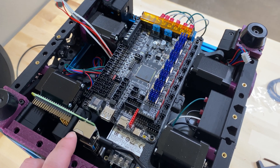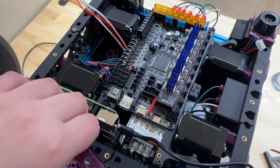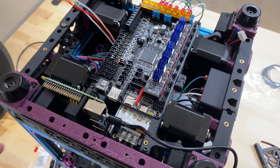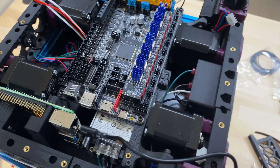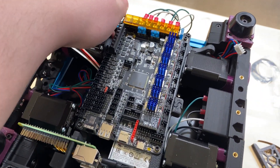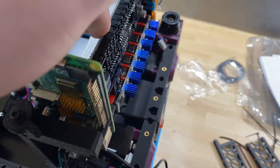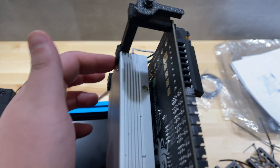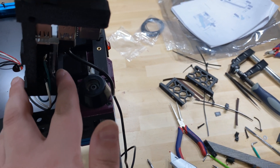Here is the new electronics mount with the Raspberry Pi in the new location. I checked and it doesn't hit the panel, which is nice. Even if the latches come loose, it'll just be the side of the PCB — no pins shorted. The setup has a hinged mechanism, though if I were designing this myself I don't think I'd go for this hinge. It's nice to be able to reach all the electronics, but the DC side is covered by the Octopus anyway, and you don't really need to reach the AC side of the power supply.